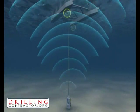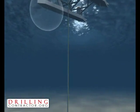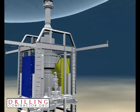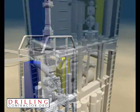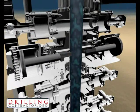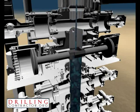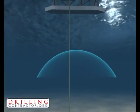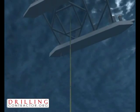Taking an individual valve actuation as an example: an incoming command is received and processed by the acoustic communication unit and passed to the SEM. The SEM in turn commands the appropriate solenoid driver module, which drives a pilot valve. The resulting valve actuation causes fluid to stop flowing through this section of the BOP. The change of state of this valve is reported acoustically, as are any analog values affected by this change — for example, pressure, temperature, and flow rate.